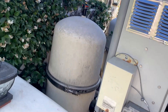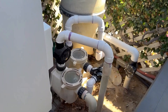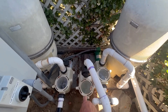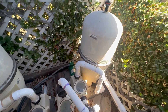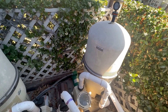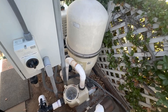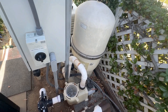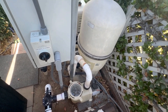I actually have two filters, a heater, and a chlorinator. Here are my three pumps. The one in the center is my booster pump — it's still on 110 power and only used when I need it; most of the time we never use it. My first pump over here is a one horsepower pump set up on a diatomaceous earth surface filter, and it basically runs the pool sweep and two sheer descents — a little waterfall. The third pump is more complicated: it's actually a two horsepower AC/DC pump, so I can run it on solar during the day and run my spa at night. If we want to use the spa at night when the sun has gone down, we can switch it over.